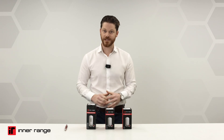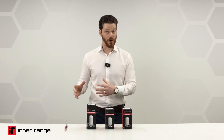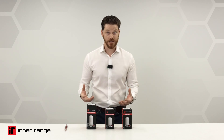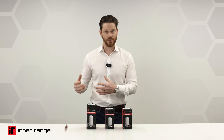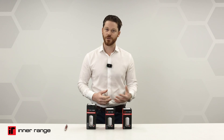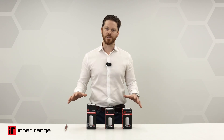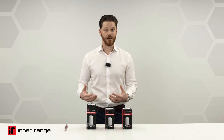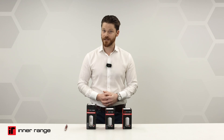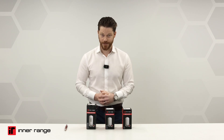This is all about saving time and saving money. If you as the security technician or even the business owner don't have to waste time manually fitting off resistors, dropping resistors, dealing with service issues, or junior technicians who may not know how to fit an end-of-line module — this does away with all those problems. This solution scales up very well. As the site becomes larger with many detectors, fitting off these detectors is simply four wires. No resistors — just saving time and money.